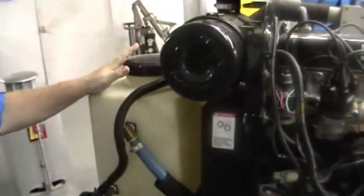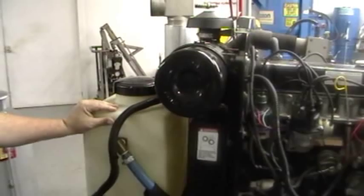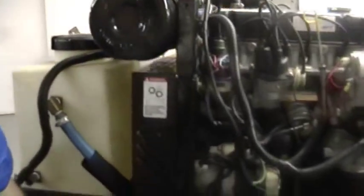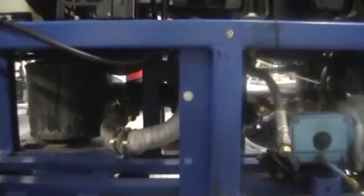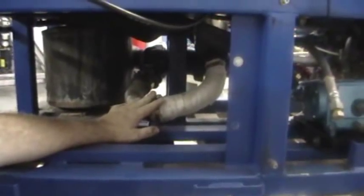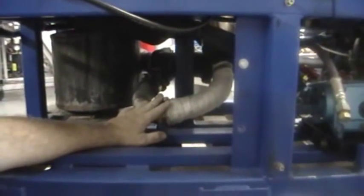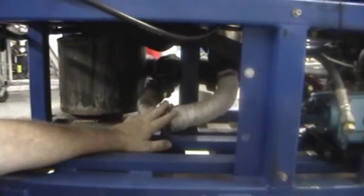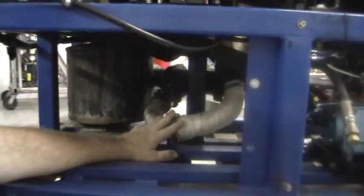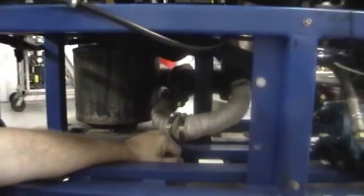We've converted it to cold water, so the float box now has cold water in it and the valve inside operates with cold water, extending the life of that valve. Look how much more room there is in the unit once we've removed the heat exchanger. Here is where the exhaust diverter was located. This is a Nissan A15 engine, and the specification says a minimum 2-inch exhaust should be used. This engine had a 1-inch exhaust, so we went back to factory specifications and installed the recommended 2-inch exhaust.